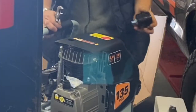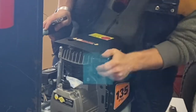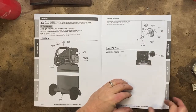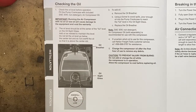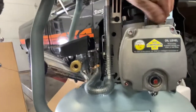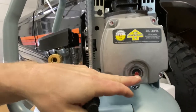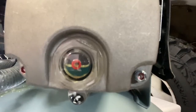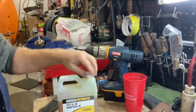According to the pictures, the air filter goes right here. Might not even need tools for this. No tools needed — air filter is now on. Moving on. Oil sight glass, and we're going to fill that to the center. So according to the directions, this is our oil breather cap — that just unscrews. Here's your oil tank. Fill straight to the middle of the sight glass. Oil is right in the center, that is full. And of course I made a mess, so I have to wipe this up.